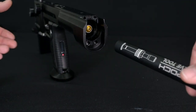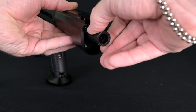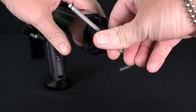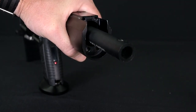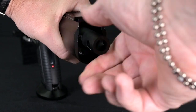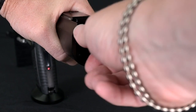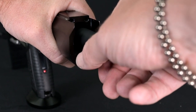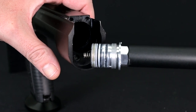Insert the tool all the way down over the valve shaft into the nut, make sure you have firm engagement, and then use an allen key or screwdriver to give yourself leverage and break it away from that initial tension. Once it's broken away, you can easily remove it the rest of the way with just your hands. Once you no longer feel any resistance in your unscrewing, tilt the tool slightly — that will capture the valve stem and locking nut to come out of the body as one piece. There's a spring in the end which you don't want to lose — set it aside.